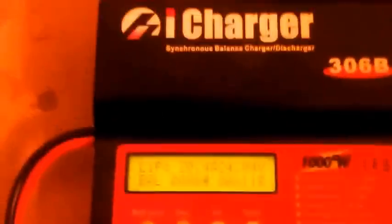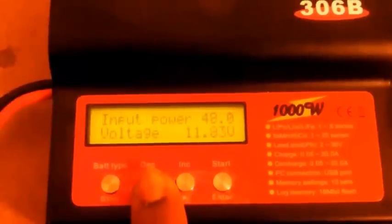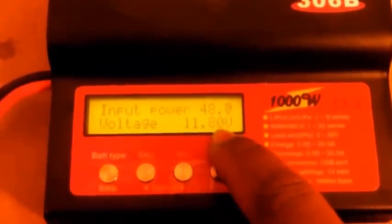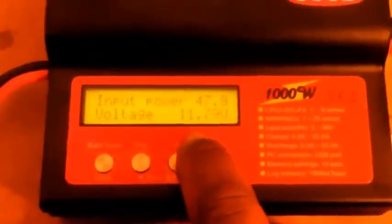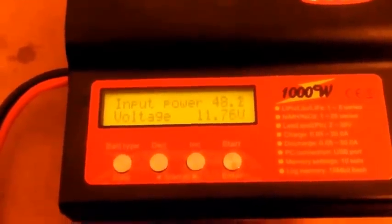Let's charge on this pack at 20 amps. Let's see how many amps it's pulling. It's loading the power supply at 48 amps. The voltage is holding at 11.79, 11.8. Everything feels good. Power supply is ice cold. The reason there's a volt drop is the wires are heating up right here, and so it's going to cause a volt drop.